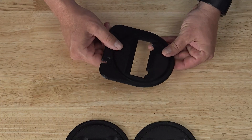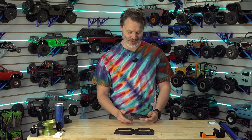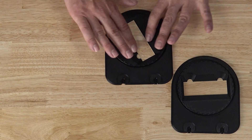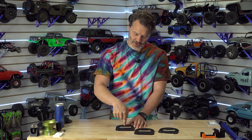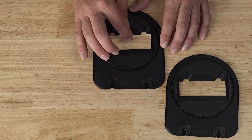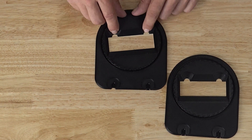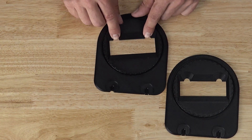Had to make this from scratch. They already had one that didn't fit and they didn't have all the 3D printing parts to print it, nor did they have printers. So by the time it was all said and done, it was quicker for me to just design a whole new one from scratch. I think mine's actually a lot better. We've got a little grip ring on this outside portion here, a chamfer for these edges so that the actual microscope lenses wouldn't hit it — because there's one that almost touches the glass. As long as you're in the center when you go to switch, it doesn't hit this holder here; it clears in all directions. And then we've got these two little places right here so that you can get your fingers or a set of tweezers in here to get the slides in and out.